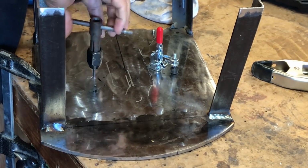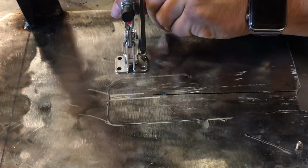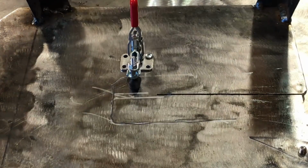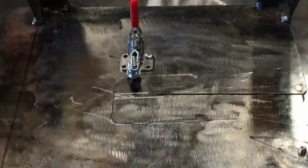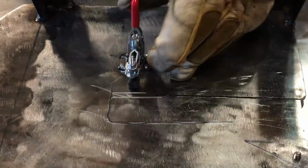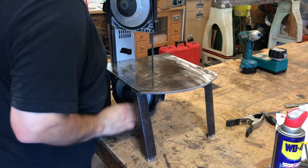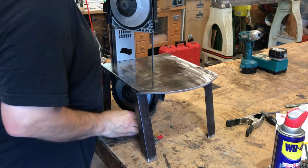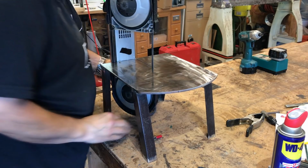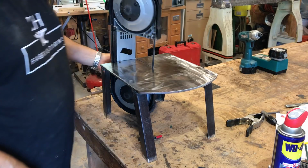Finished that one up and decided I would just plug weld the other 3. Then pull the screw out and plug the last hole. I did grind away the plating first on a wire wheel on my grinder, hopefully to get rid of any harmful gases. And here's yet another wonderful welding job of myself here. Catch the slow motion. Yes, that is the toggle clamp now laying on the bench when I tried to lock it in place. Okay, strike 2 for my welding skills here.